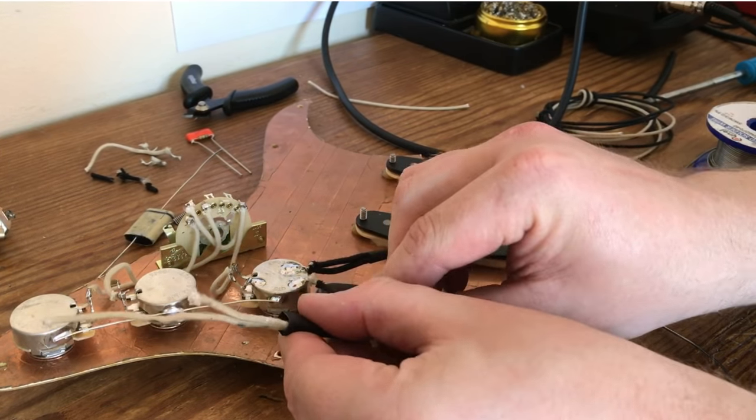That's all soldered in place — we just need to ground the second lead to the inner casing of the pot. Again, try to be quick due to the heat from the soldering iron having a tendency to melt the wax. Obviously if you take too long you can have wax everywhere, which is not ideal for anyone, not least your guitar. That's pretty much ready now — the final thing is to install the jack. I'm going to see how it sounds without the treble bleed first.